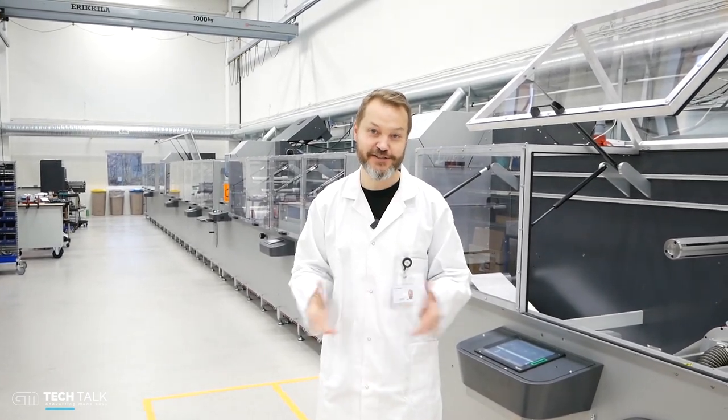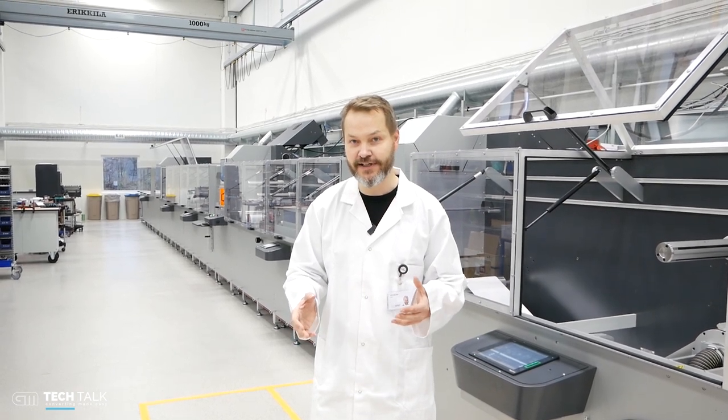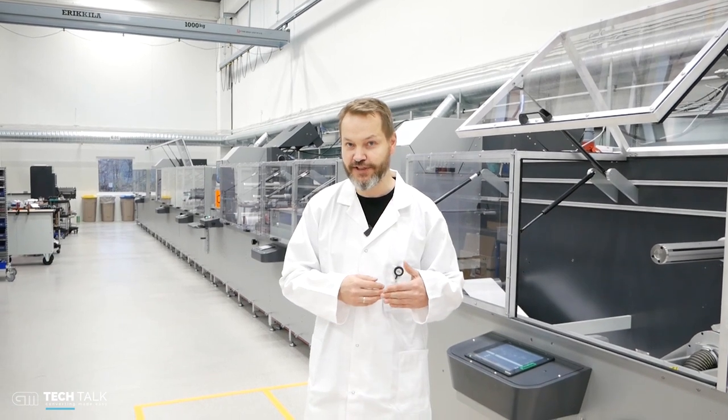Welcome to this presentation video of GM's scientific lines. This is the Solar 300 — it is our newest and greatest. It is a special line for coating of solar cells and coating of specific functional materials, so thin films with very delicate print on. The line features slot die coating, gravure coating, and other special print stations. It is designed to be modular, so after installation you can easily split it and install another module if you need that. Stay tuned and let me walk you through the line and show you the individual modules.